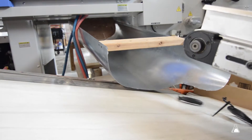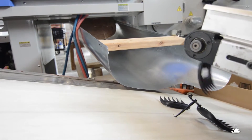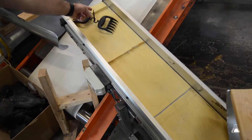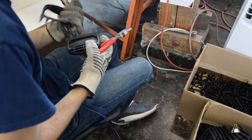You can kind of see the mold closed in the doorway there, and there it opens up. We're able to manufacture a pair of bear paws every 23 seconds using this machine. We just have a belt system that leads up to Jacob up there — he clips off the runners. This part right here is called the runner, and he clips those off our product to make sure they have a nice smooth finish on the handle.